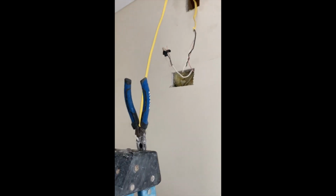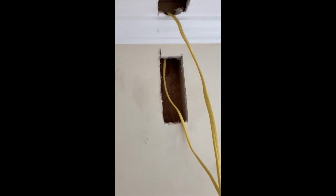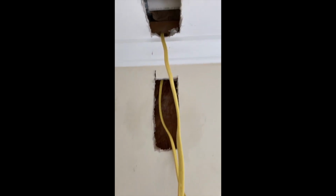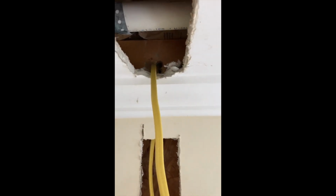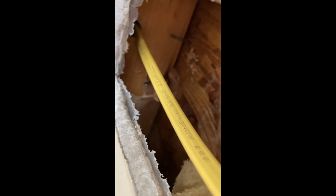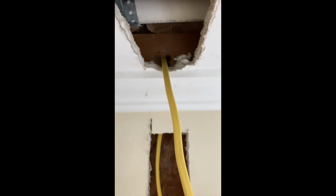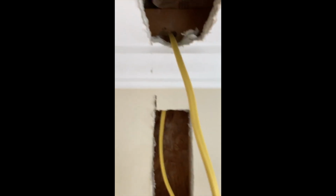So we needed to get wire into the ceiling, into that spot. So here's what I did. I cut a hole into the wall enough to get my drill in, and drilled straight up, put a hole in the ceiling and tried to drill right into the hole that I drilled, because of course in that corner we got wood back in there that's holding up the second floor. And so we drilled into the 2x4 there and the 2x6 up there. Drilled this way and this way and just tried to make a match.